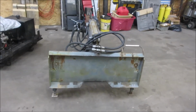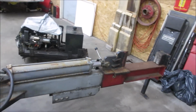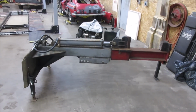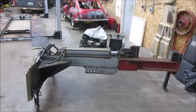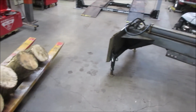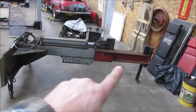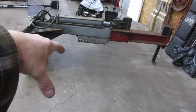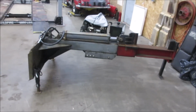Anyway, I was at the diner and I was talking about what I ended up picking up, and he wants the log splitter, and he has 2 grapple buckets that he doesn't use very much because I guess he's got an excavator or whatever. Anyhow, so I want to jump on this, get this machine up and running, look into the power unit, see how it is. And he's already dropped off a couple of pieces of wood that if it's able to split them, he'd be happy with it. One thing that he wants to do also is he wants to be able to cut it and flip it around so that the hydraulics is on the bottom of it, so that he could just sit in the skid steer and line logs up and just kind of fire it from in there and bust up the logs without even getting out of the tractor.